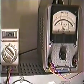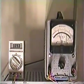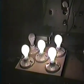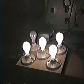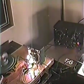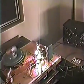so we still have less than 1/3 of a milliwatt of power on the grid. And from that we're pulling out of the vacuum, from cathode to plate, we are gating and controlling well over 400 watts of power. You can see the four 100-watt bulbs brilliantly lit, and when I get off to the side you'll see just how brilliant they are when the camera readjusts.